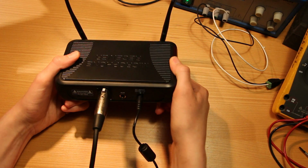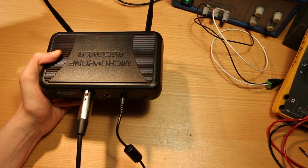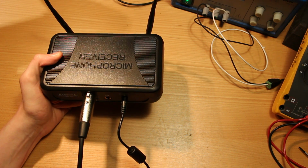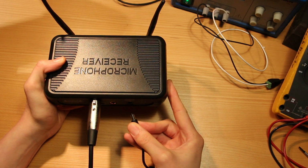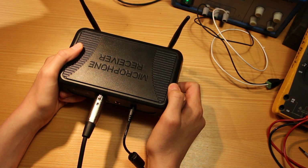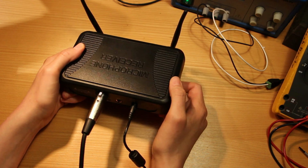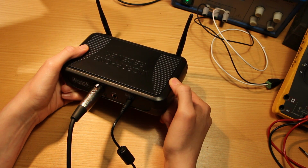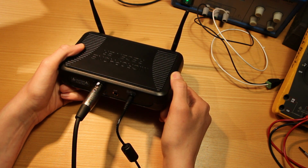All right, just for another test, let's see what happens when we unplug the input power, just to see if that's an active source of this noise. There's definitely some noise with the power unplugged, but it's different than the noise with the power plugged in. It's more like the kind of lower frequency hum that we get when the output just isn't being driven.